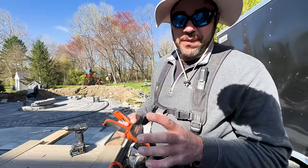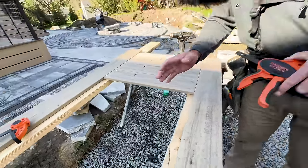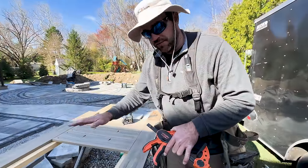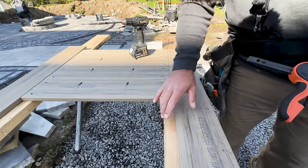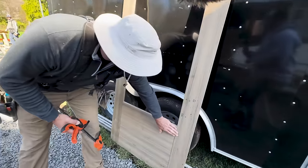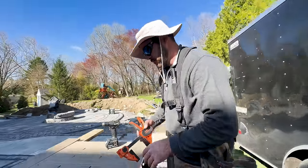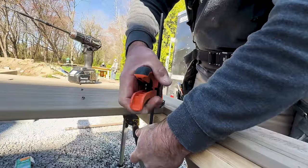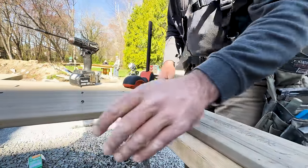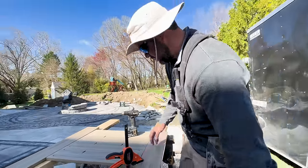So a good tip is clamping. What clamping does is I have these 2 2x6s that act as like a subfloor that's flat. And when you clamp everything down and my faces are touching that, it lets you get that smooth transition. Clamping it down tight allows me to know that my face is nice and flush.